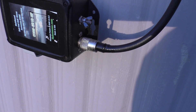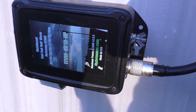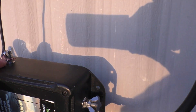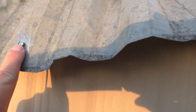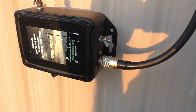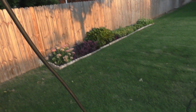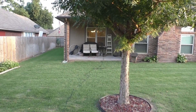So I've got a nine-to-one balun. What I have is a nine-to-one antenna balun here, and I have just about maybe eight or ten inches of wire coming up here. I tried to file it to make a good contact, and I have my wire right in here going down to my balun. I have coax going down this way about 50 feet. I have a very small yard — it's going in the back window there, so let's go check the SWR.